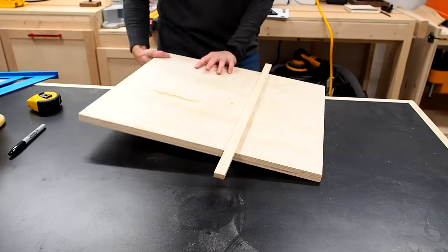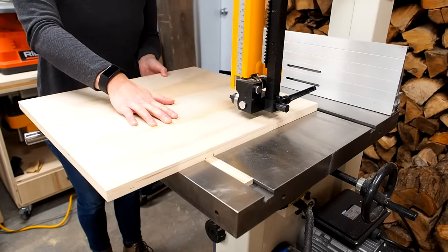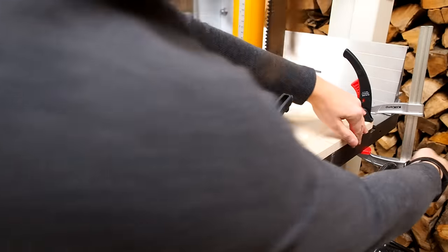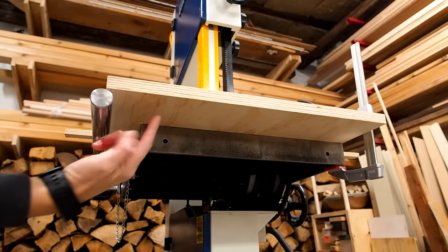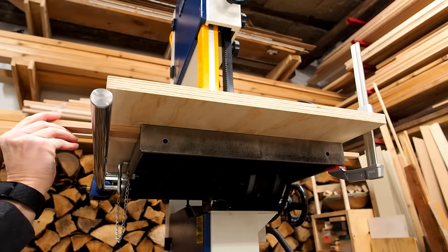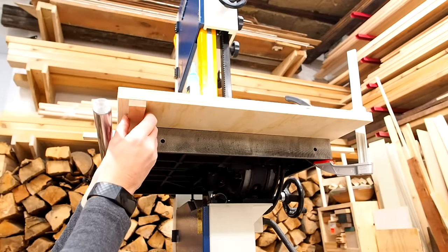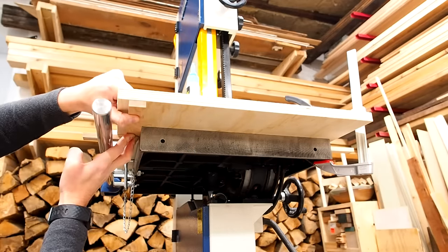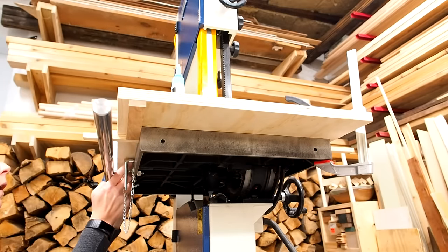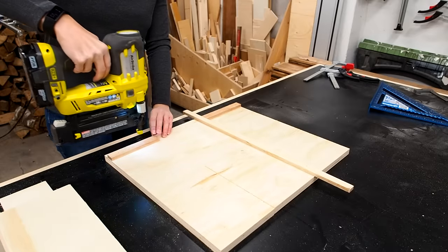With the runner secured I installed the jig on the bandsaw and cut the kerf stopping roughly halfway through. At this point I used a couple of clamps to lock the jig in place temporarily. The jig overhangs the table at the front so you can secure a stop — make sure the stop is thin enough so it won't hit any obstacles. I used a few dabs of super glue to secure it under the sled, then added a second stop on the other side before securing both stops with brad nails.